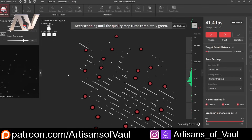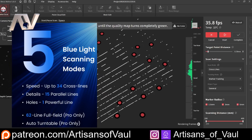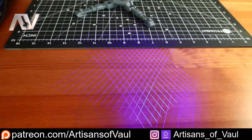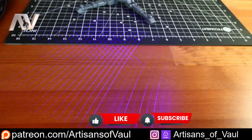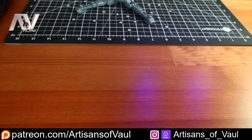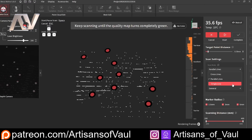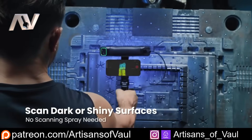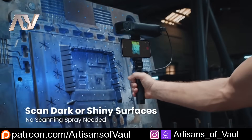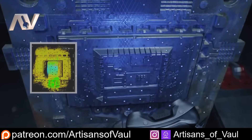There are a couple of different scanning modes you can use with the Metro Y, and even more with the Pro. The crossline mode is meant for general detail and gives you the fastest scans, covering the most area as quickly as possible. Parallel mode gives a bit more detail and crispness at a slight expense of speed. Single line scanning is designed for capturing areas with greater depth that are otherwise hard to reach. There are also settings to scan dark or shiny surfaces like metal, which you can't do with a lot of other non-laser line scanners, but we won't need them for this project.